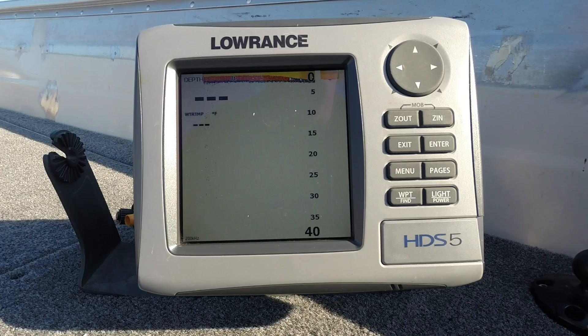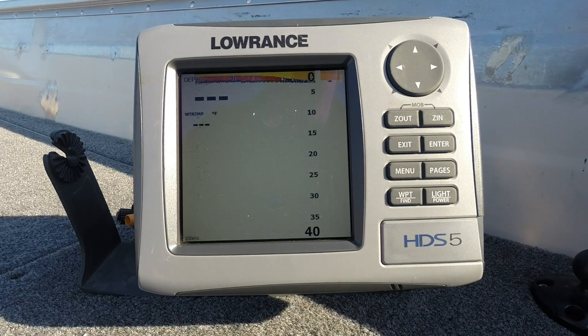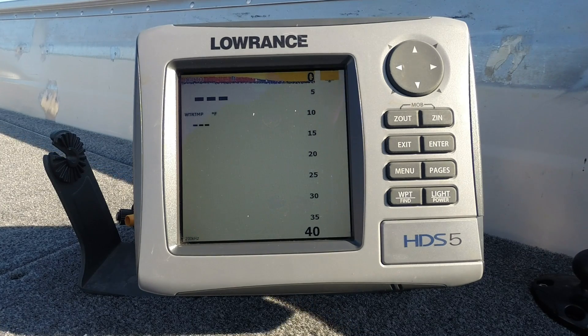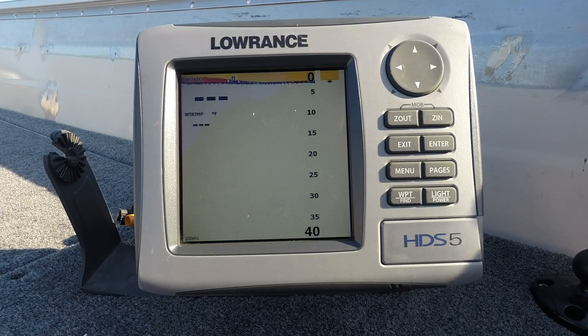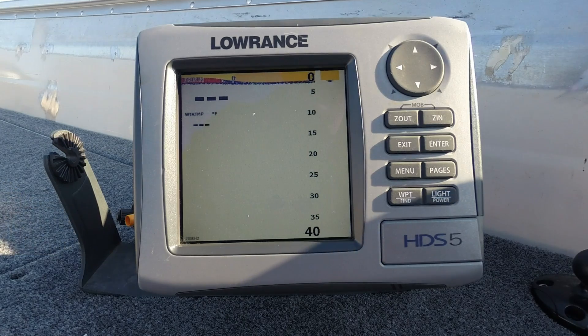Most people would stop here, but what I'd recommend is take the HDS 8 and plug it into the transducer on the bow of the boat — that'll 100% verify it's a transducer issue if that unit works. One nice thing about Lowrance units is that just about everything from the LCX series, LMS series, and HDS series — Gen 1, Gen 2, Gen 3, touch or non-touch — they all use the same transducer and power connection, going back to units from 2001. So any unit you or a friend has can work with your existing setup. Note that units using the Uni plug connector won't cross-connect, but LMS, LCX, and HDS will all plug into each other.